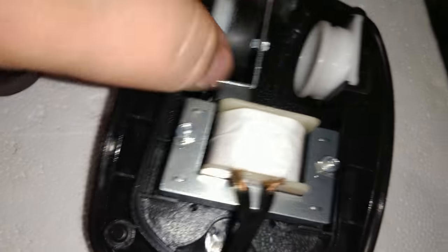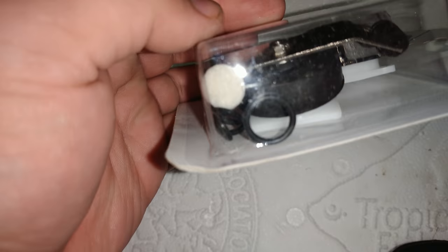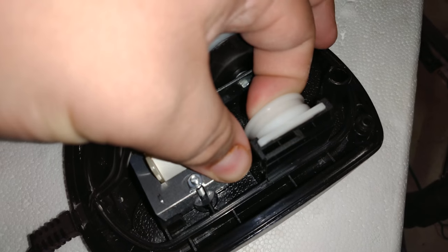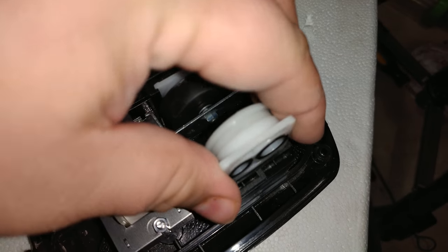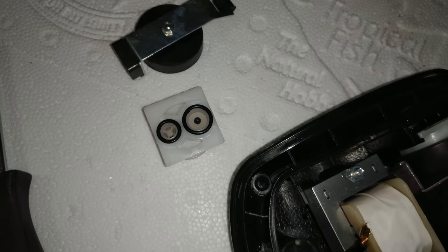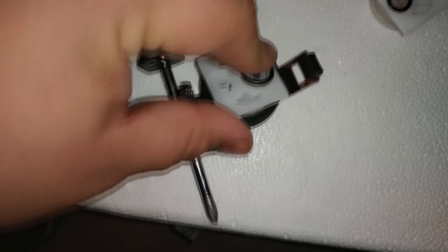There are some pieces that come with the repair kit. As you can see, there are new gaskets. This plastic piece right here where the diaphragm sits does indeed slide out as well. You pull up and it comes right out, and these black pieces right here are the rubber gaskets that you're going to replace. In the new kit they give you, it comes with the diaphragm and this plastic piece. You'll notice that the rubber gaskets are not already pre-attached to the plastic piece, so we take the appropriately sized rubber gaskets and place them into the plastic piece.